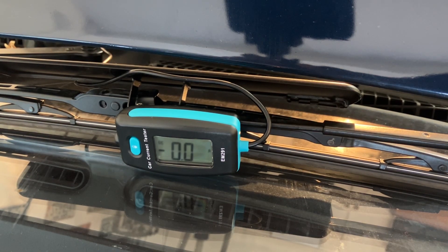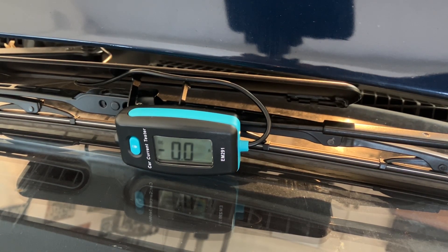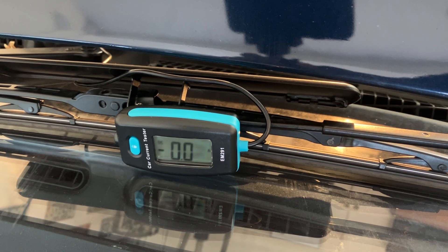6.8 — so you can see it took 6.8 amps. It's a 30 amp circuit, so there's plenty of margin there. The motors are not in too bad condition on this one. If you were getting somewhere up near the maximum — say in the 20 amp range — I'd assume the motor has high degradation, taking a lot of current to turn due to rust and internal faults, and I'd be looking to change the motor.